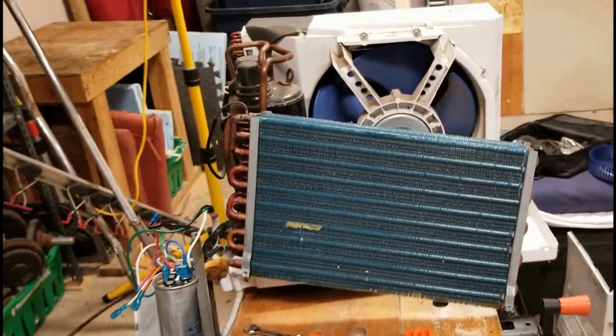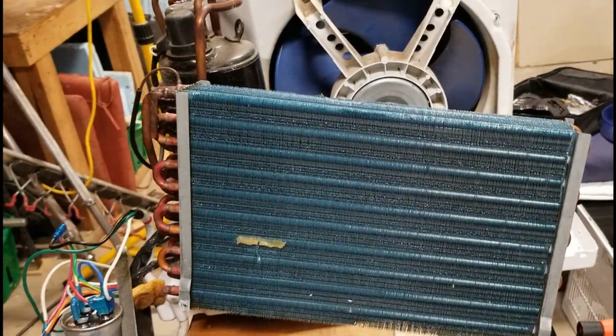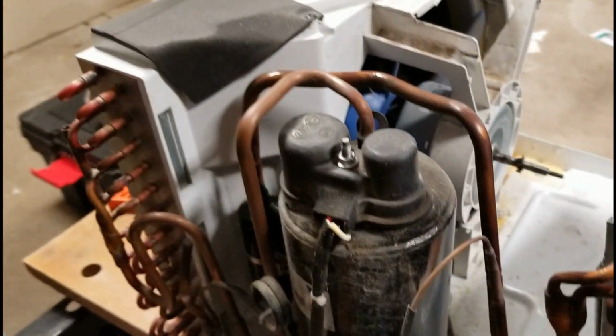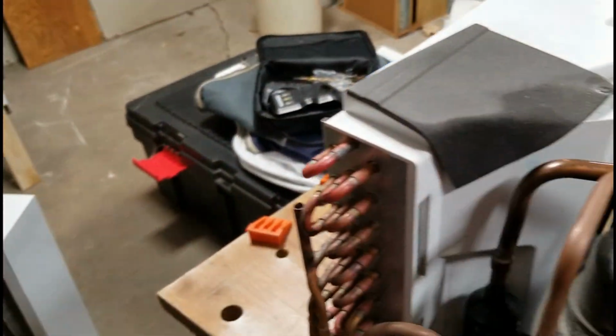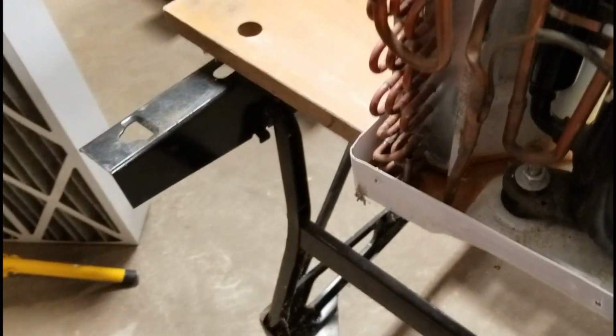In an air conditioner, you've got air running through usually at like 75 or 85 degrees Fahrenheit, which is enough to excite the refrigerant, so that when it pumps back through here, into what's called a receiver down here, and into the compressor, it's still in a gaseous state. It's full of heat, so the compressor can then compress it, and we can remove the heat as it's going through the condenser. So here's our top part where it comes out, and it goes down into our condenser. It removes the heat, then comes back through here, pulls the heat back out of here, and gets compressed again.